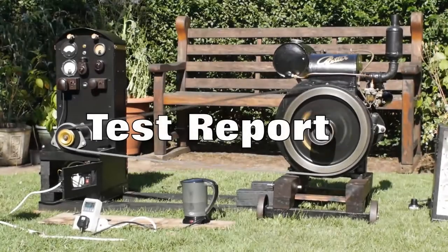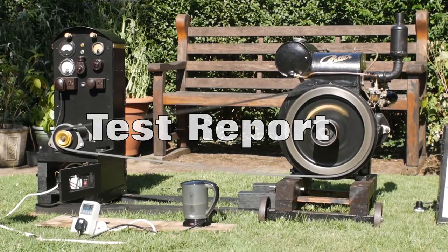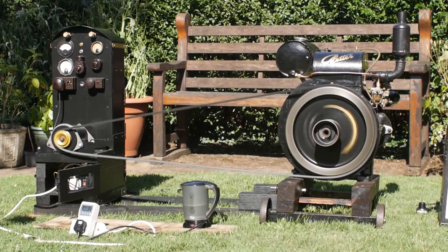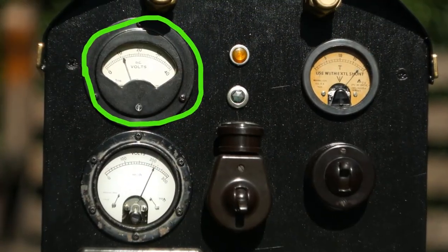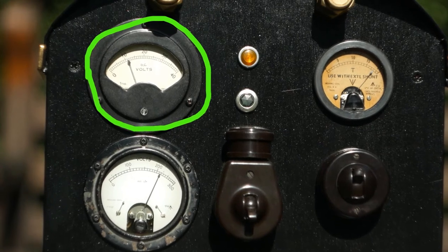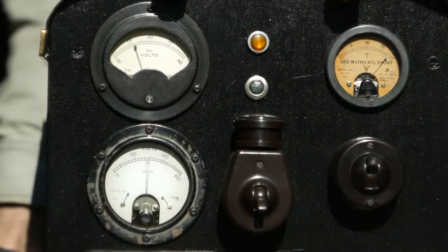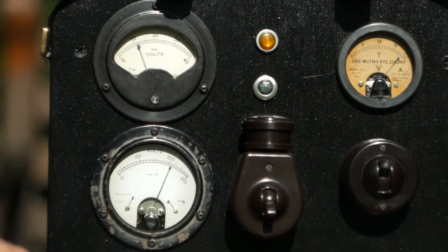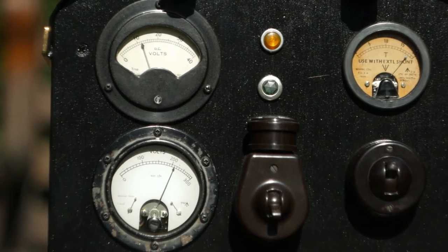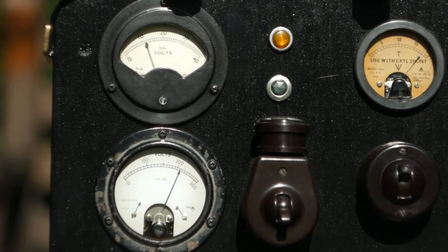Okay, well that all worked fairly well, albeit not without a few problems. You could probably hear the bleeping that started around 1 minute into heating the water. That's the low voltage warning on the inverter because the dynamo wasn't able to keep up with the power supply. Around the 3 minute mark, the inverter started cutting out due to the low voltage, but it would immediately cut back in because with no load, the voltage would jump back up to 13.5 volts and the inverter would restart.